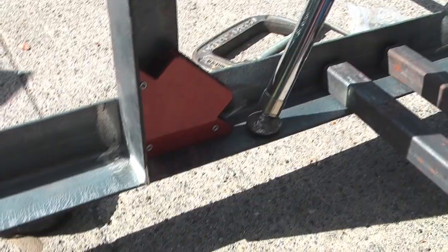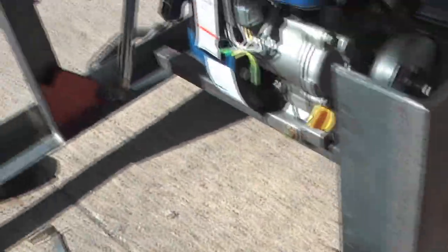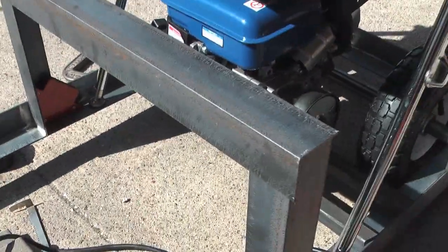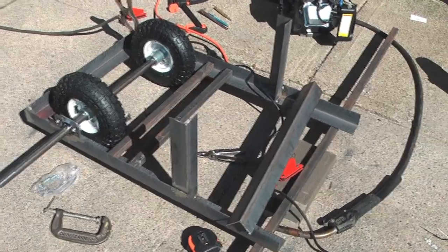I got the steel cleaned and ground off a little bit so it fits tighter on the radius. I've got the welding magnets holding the pieces in there now so they're perpendicular, square, and not all crazy. I'm gonna tack them in with the welder and work on getting the top bar in — it'll look something like that — and then we should be a little bit closer.